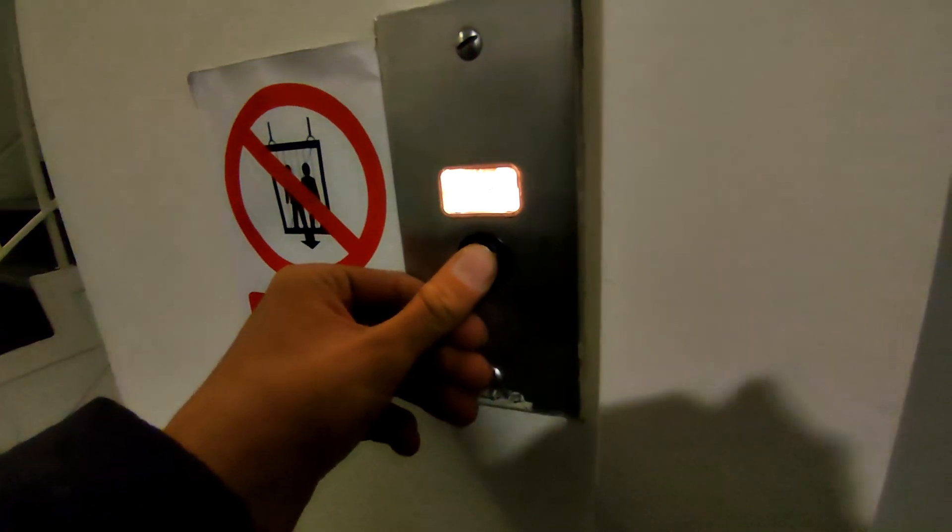So if I shut this, let's see now if the lift will come down without overrunning. Come on lift, don't overrun this time. You can see the lift coming down. Now overrun again. The switch isn't straight, it's bent. Someone's bent it. Now I'm going to take the lift up but this time I'm going to go in the lift pit and have the lift come down on top of me, because that's fun and also very dangerous.